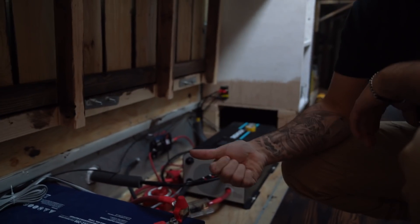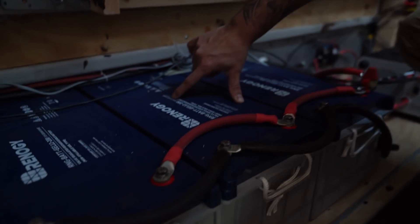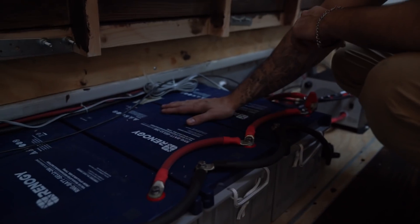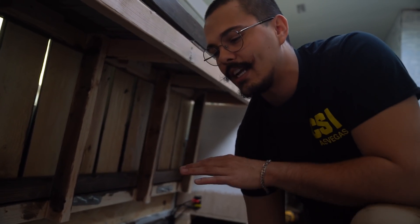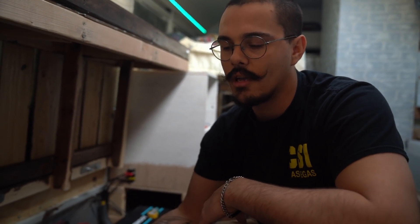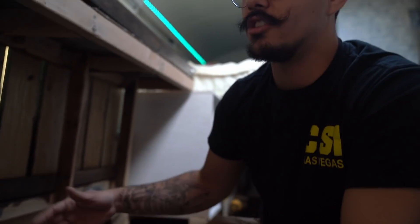The main thing is batteries. These are 12 volt batteries — they're 200 amp hours, which is basically just how much it can shell out in a span of time. This says 200 amp hours by 10 hours. You need a big battery system because if batteries keep running low, it's going to damage the battery. You need a battery storage system that is big enough for the amount of electrical components you're going to have running off of it.